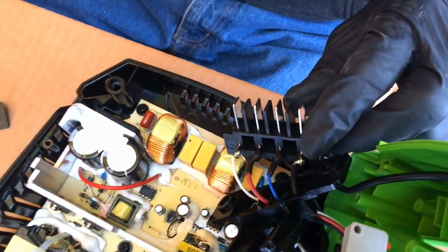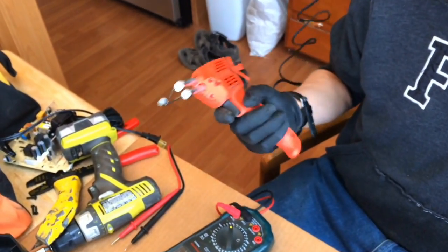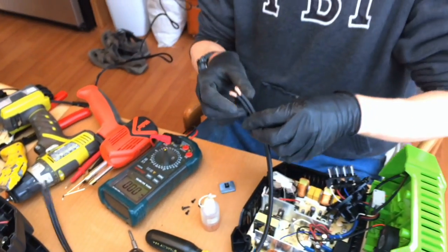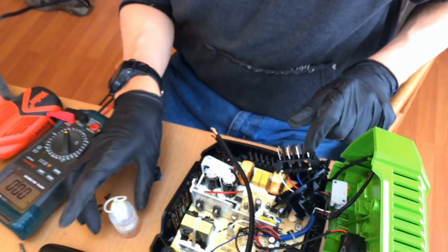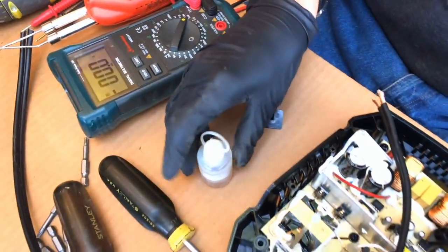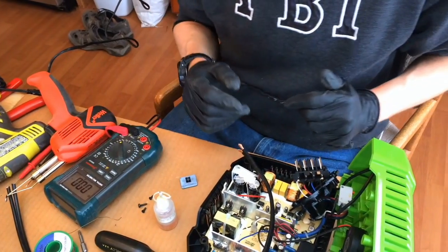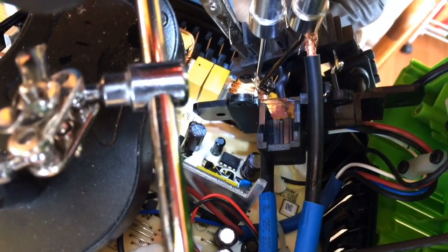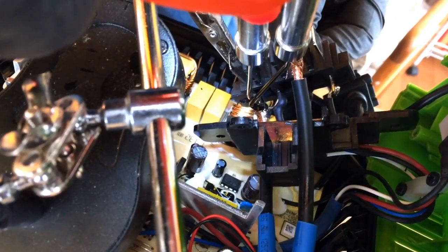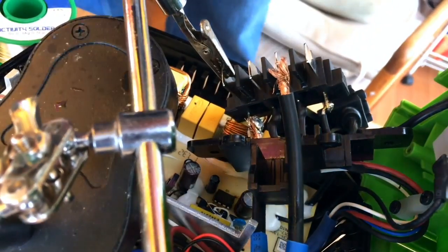What we're going to have to do is solder. I've cut away the heat shrink tubing and we're going to solder directly to these metal tabs, which can be tricky because if it gets too hot it's going to melt the plastic. You want to use a soldering gun — I use a high-power Weller gun. We're going to solder this 12-gauge wire directly to those tabs, and the key to making that work is flux. You want to use flux and flux-core solder because you just can't have enough flux. I definitely shouldn't breathe the fumes, but it seems like I always do.